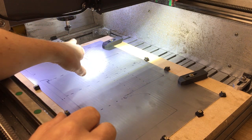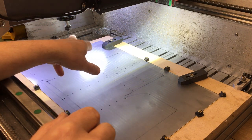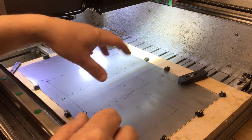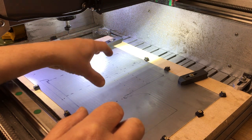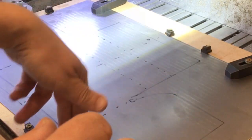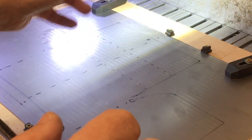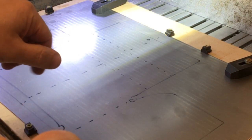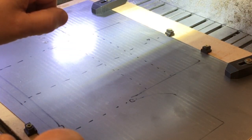Right, so we've got a 3mm end mill in here, and we'll get the zero set, and then we'll carefully, maybe quarter, I can't remember what I did in the CAM, quarter, half millimetre at a time, go around and cut it out. I left some tabs in it as well, and then we'll just clean the whole thing up, and then we'll have our net shape done, and then it's ready to do the bending. So let's touch off, and then we'll get started.